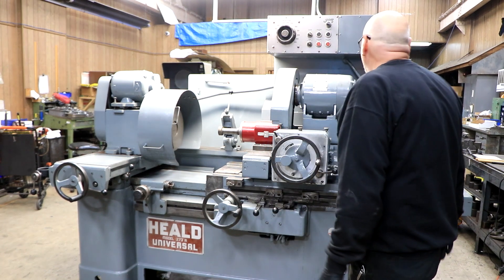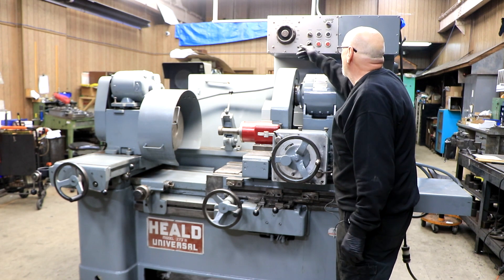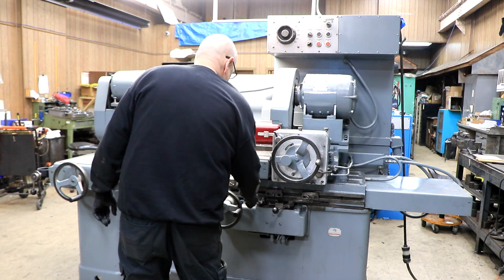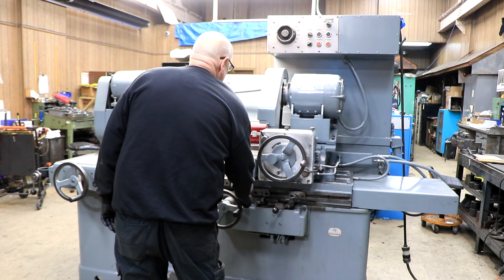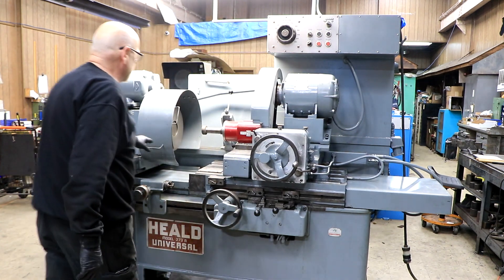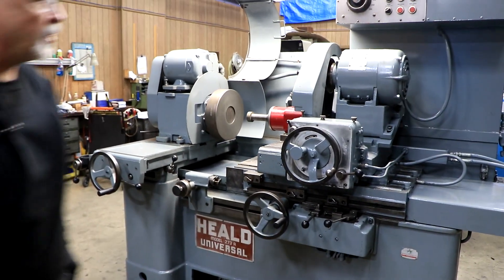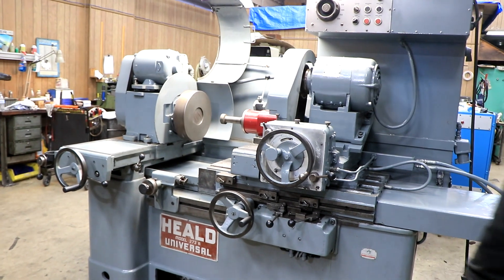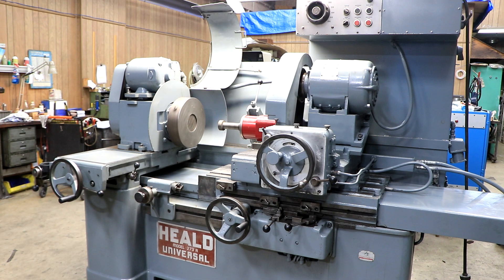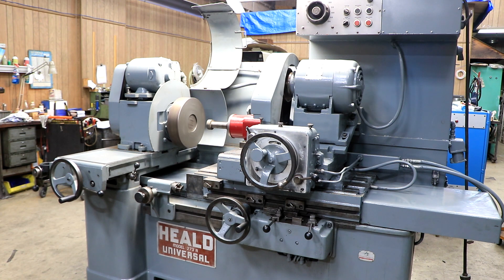Right now I'm in the park or home position. So if I put this into auto, when it's all the way at the back there's a switch that gets made and it will shut the headstock off. So when I come in now off that switch, your headstock will start again. What's happening right now is I don't have this switch adjusted properly — each time the machine is traveling it's hitting that switch. So I'm going to stop right here and talk about a few other things.